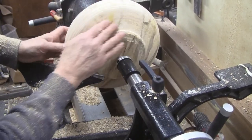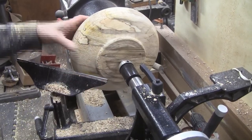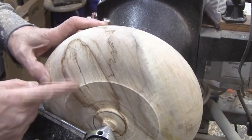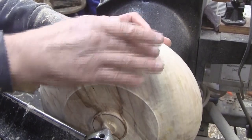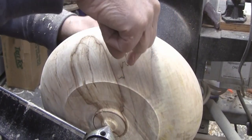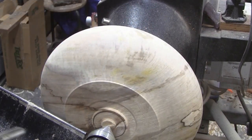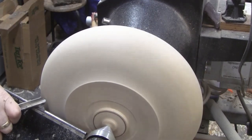We can deal with it — that's real nice. So I'm kind of looking at that crack and I think I can get rid of a little bit more of it. I want to do a small design change right here anyway. I have this coming like that but I'm thinking about bringing it up more square. Got my half-inch bowl gouge here and we'll see what we can do by trimming that up.